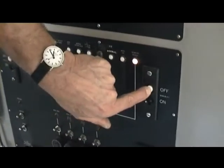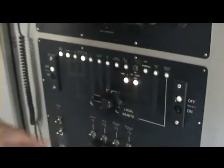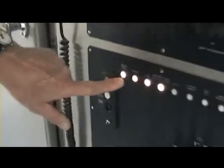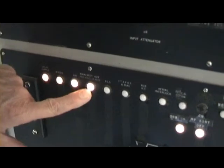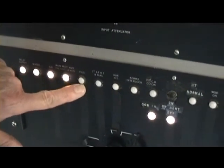Let's take the HT off and put it to local. This one's already on. Up we go — we've got relay supply, we've got the water coming up, it's already there, the air supply's on. The preamps have got their supplies and we're just waiting now for the filaments to light.